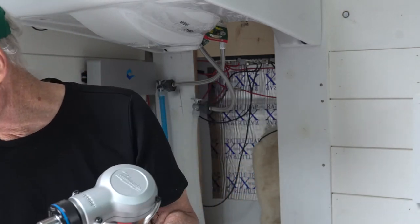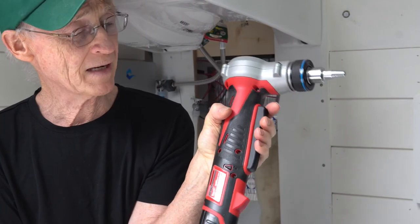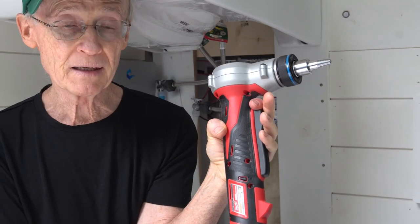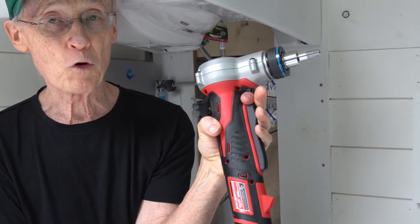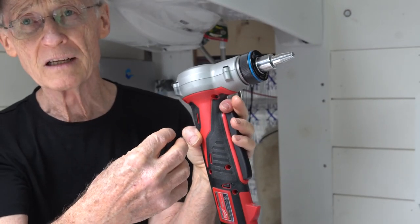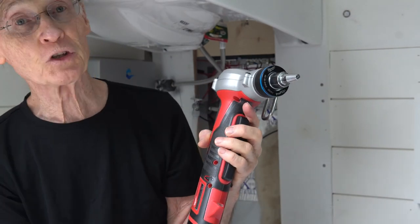There's the finished result. If you're building a van and only have a few connections to make, this tool may be a significant expense. The alternative is PEX B piping with crimp rings — the crimp ring tool is quite a bit less expensive, maybe forty to eighty dollars. With that method the fitting slides into the tubing freely, a ring goes around the outside, and you crimp the ring to squeeze the tubing and make the connection. That's another alternative way of doing the piping.